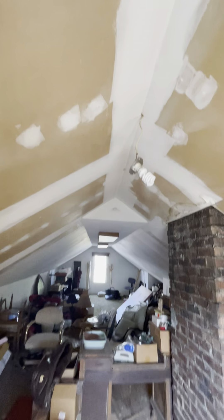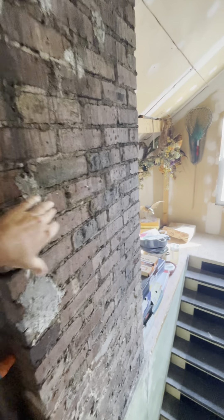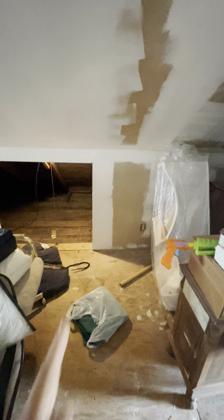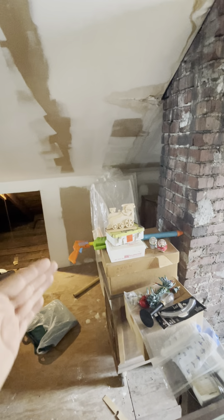Hey Doug — a couple technical things. We're going to build a closet right next to this brick, and we're going to expose the brick. On day one, do a nice light wire brush on all the mortar joints to knock them down, then do a gloss sealer on there to make the brick pop. We're going to split the difference — I think this was 18 inches, coming back to 9. Run our wall right here, do a closet about 41 inches wide, put a 30-inch left-swing door on there so it swings into this half wall. Put a closet rod that goes all the way back.